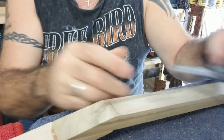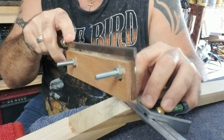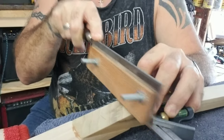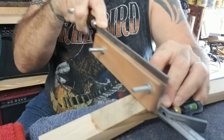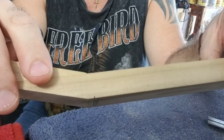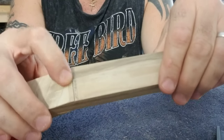What I'm going to do — I've got my little square, and I've got it marked off where the nut is going to go. I'm going to put my square there and take my saw and just cut one slot right here. Now you can see the depth of the cut and it's pretty much the same on the other side. I'll cut about three or four little cuts within that marked area there.